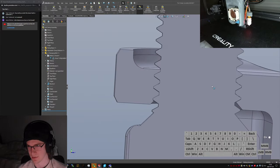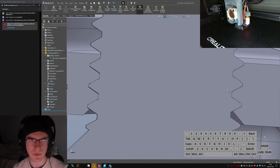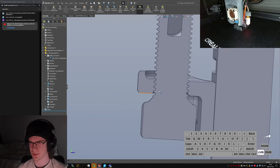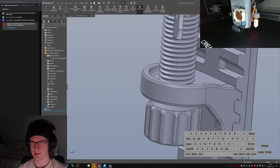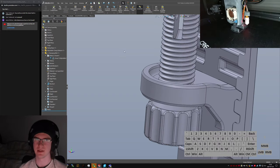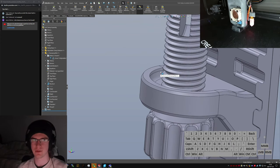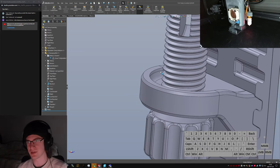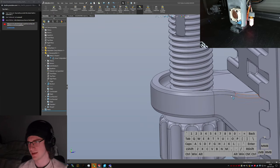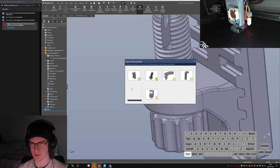Yeah, okay, so by default, it models it with no clearance on those threads, which is frustrating and dumb, but SolidWorks explicitly tells you that the threads it generates with the thread tool are not to be used for actual manufacturing purposes, and if you do need to manufacture them, you should be looking at the Machinery's Handbook to figure out what the threads should look like. So what I'm going to do, or what I usually do, rather...